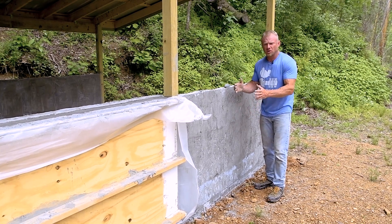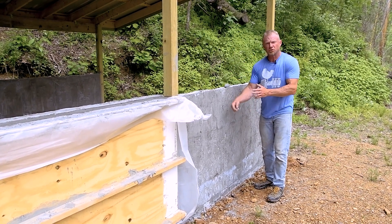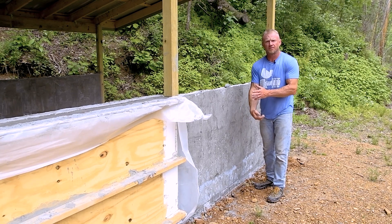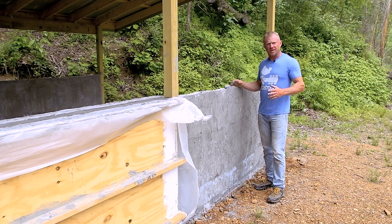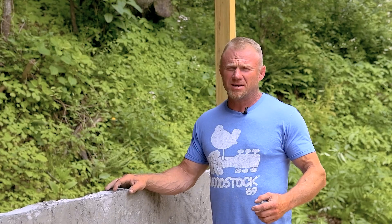One of the other issues is that aircrete is so lightweight that as you fill the form up, the weight of it wants to push it out the bottom — it very easily runs out the bottom. So we took regular cement and mixed it up kind of thick and dumped it in between our forms, starting off about two inches thick. The reason we use cement at the bottom is: one, it prevents the aircrete from running out the bottom by working as a plug once it sets up; and two, it gives the aircrete a more solid foundation to sit on with less water wicking up.